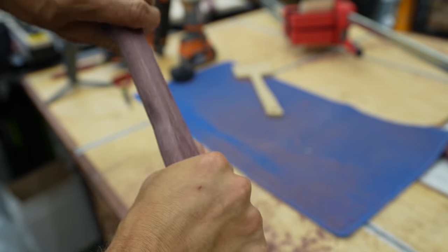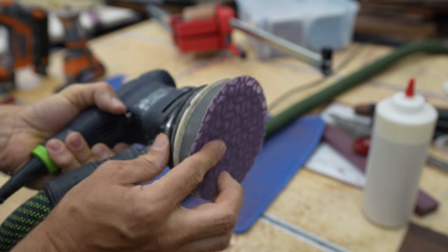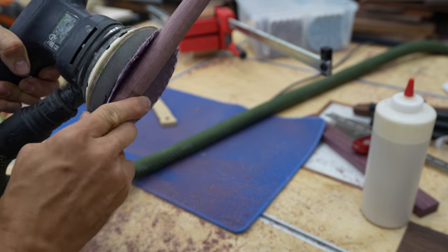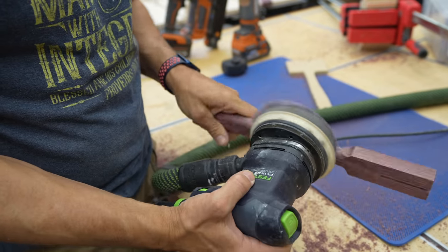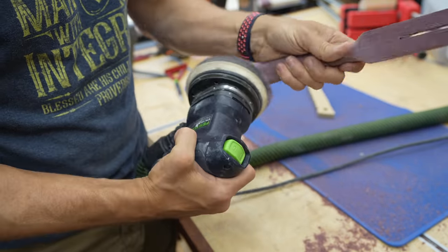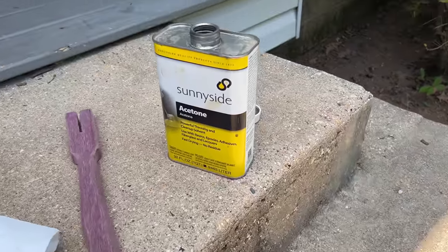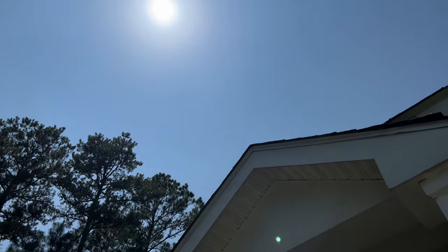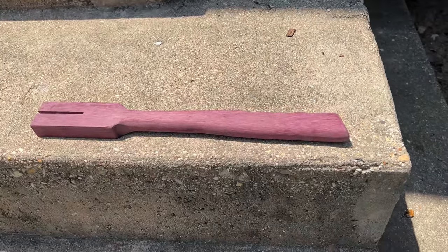It gives the handle a nice rounded finished feel. I've got this squishy pad that goes onto my sander — it's going to allow me to get on those curves really well and not damage any of the round over; it's not too aggressive. Once you start cutting and milling Purple Heart, you'll notice that your purple color goes away, but you can get that back really easily. Thanks to James King — I found this on his website. You just wipe your Purple Heart down with some acetone and set it in the sun, rotate it about every 30 minutes, continue to re-wet it with acetone, and your purple color will come back. I'll put a link in the description to James King's article on this.